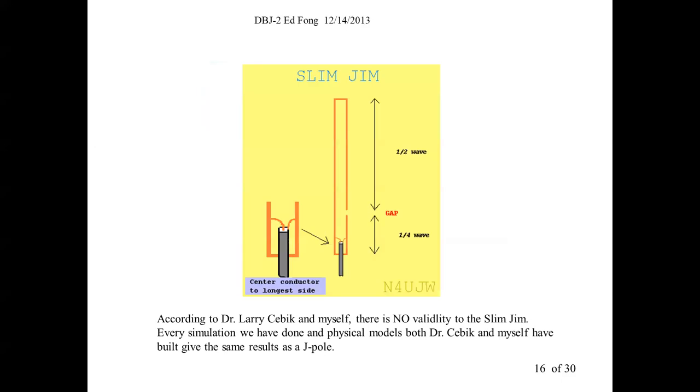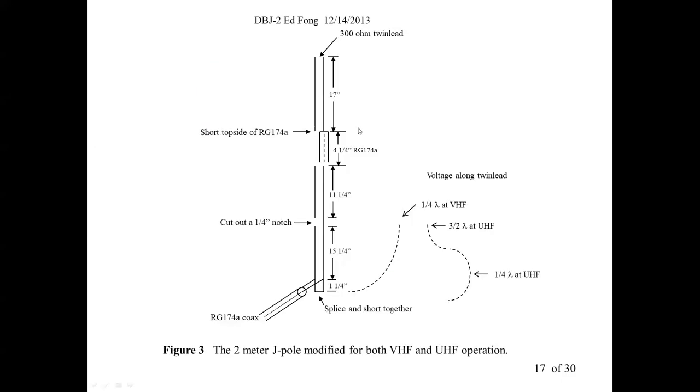So how do we stop that? Again, go back to this quarter wave stub. We use this quarter wave stub principle here and up here. We put a piece of coax here. We short circuit it up top. Remember, a short circuit, a quarter wave later will be an open circuit. It may not be infinity, but it's in the several thousands of ohms, much more than 50 ohms. It's in the several thousands of ohms at that resonant frequency, in this case our UHF ham band, and it turns out to be about 4.25, 4.5 inches.